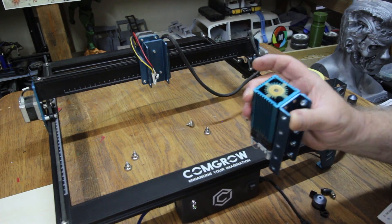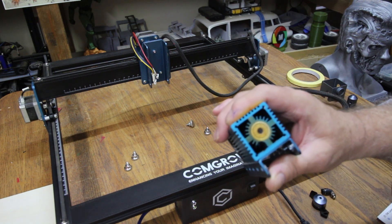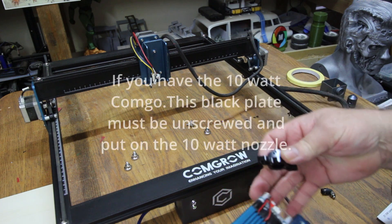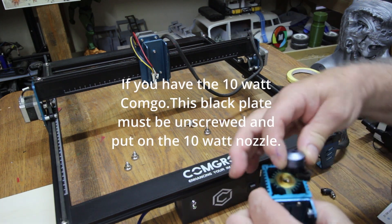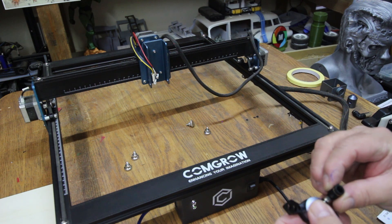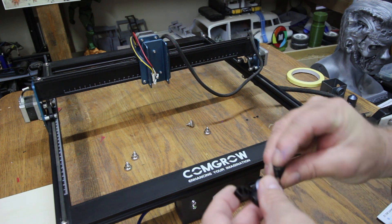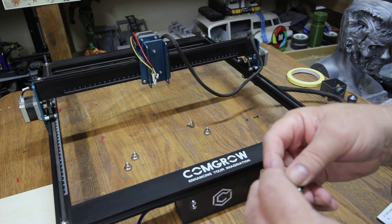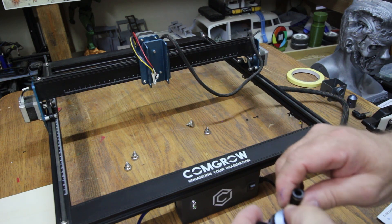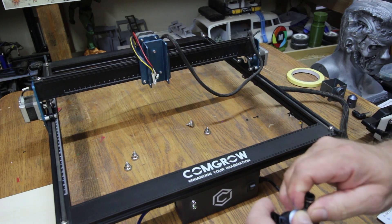A little IPA on a microfiber towel will work fine. There's a little adapter that goes on for the air assist. You can see the wires that come out on one side — you want the air assist fitting hole to be on the same side. So we're going to put two supplied screws back in diagonally, and screw this little fitting in. It screws into the side — get it started and screw it all the way in.